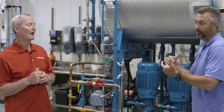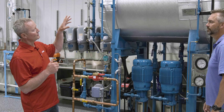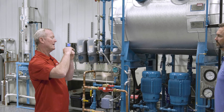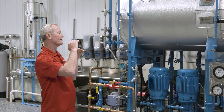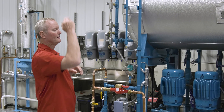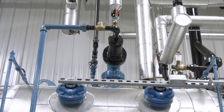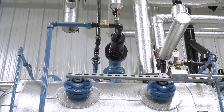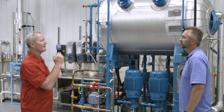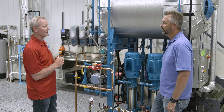What is it actually doing to get the oxygen out? It's called stripping. Steam comes in and shoots through the makeup water, which breaks those oxygen molecules up and kicks them to the top. There's a vent that goes outside, so it's continuously venting to the atmosphere. There's a three-quarter inch valve on top — the gate in that valve has a hole drilled in it, sized for this tank, that allows oxygen vapors to continuously emit out of the water.